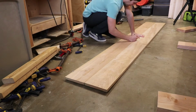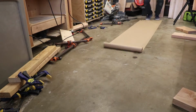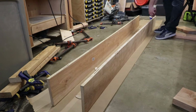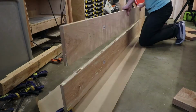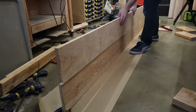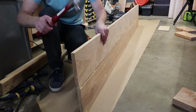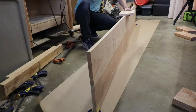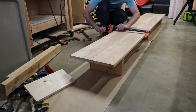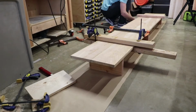By the third and final glue up, I had the process down to a science. The only problem was that these boards were the most warped. Even though they weren't warped a ton, when you spread that over 8 feet, it makes lining up the boards a bit difficult. Both boards had a bit of an arch spread over the length of them, and in order to eliminate that arch, I flipped one to be a valley and the other to be a hill. In the end, it actually worked really well to counter the problem and make the pair really flat. The extra 2x4 clamping I'm sure really helped that as well.